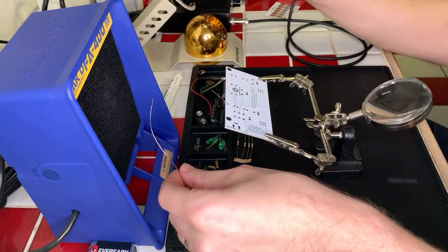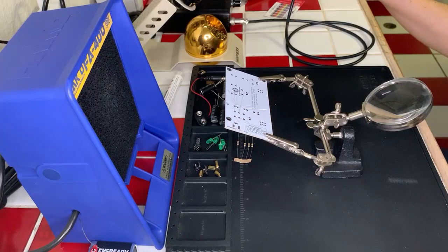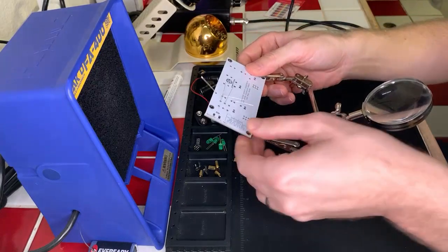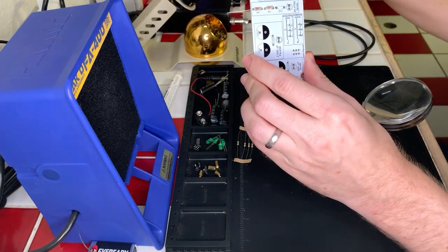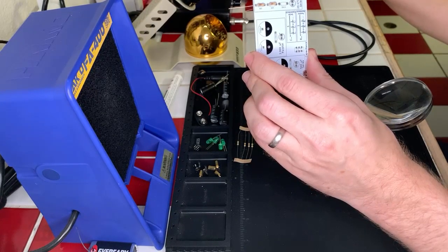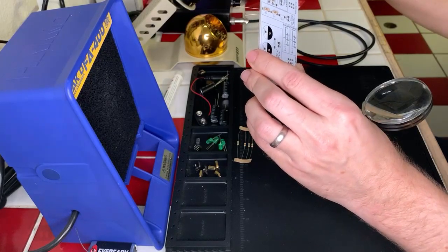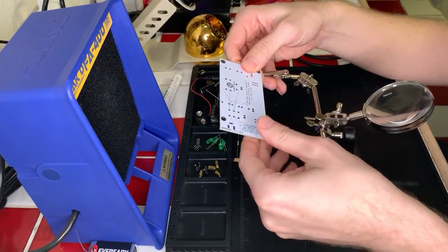Okay, that looks good. And I'm actually going to take a moment and double, triple check my resistor values, because I don't want to get this wrong. Resistor color code calculator. Perfect. And the color on this is brown, black, orange. So brown, black, multiplier is orange, and calculate it. It says 10,000. All right, so that looks good to me. We are solid and ready to go ahead and solder these on.